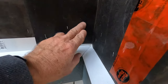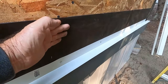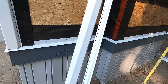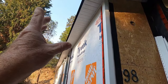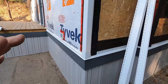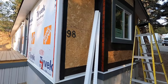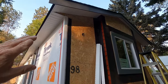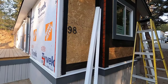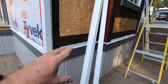Same thing on the inside corner — you can see how I've come down here. The house wrap will come down over this flange, so any water will be directed out. Done this way, combined with our overhang and eaves troughs, you will never have any more rotten rim joists. That problem is solved by doing it this way. This is done the way you would do it in a residential stick-built house — we're following the same techniques. It's a bit different than the way mobile homes are done from the factory, which is done fast and done cheap. Here we spend a little bit of extra time and money to get it done like a house.